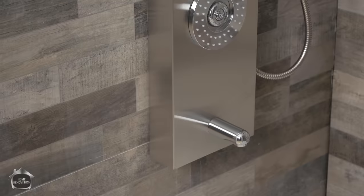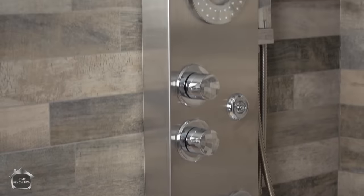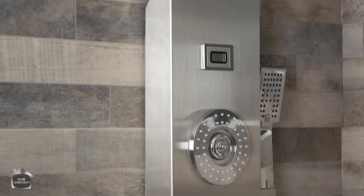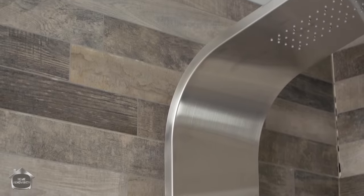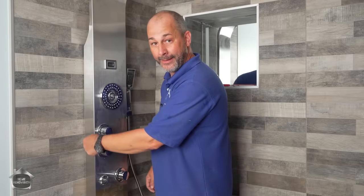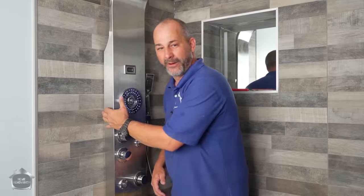Don't get hung up on the details. This is a fabulous system. And for God's sake, don't pull out the clear silicone and start getting that goop all over the side of your, just to think that you're waterproofing it. That's a waste of time. It looks ugly and it'll end up coming loose because this is a wet area. And silicone that sits in that much water with something that's moving, it's gonna break loose of the seal. You're gonna not have clear anymore. It'll look translucent, white, nasty. Leave it pretty, leave it like it is, all right?